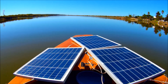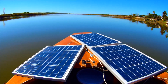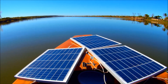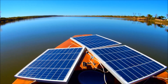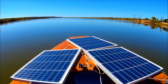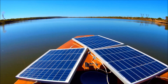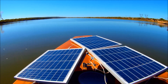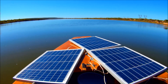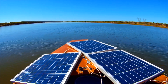These are 50-watt panels, but with the sun so low we're just not getting that power. They put out maximum power at 18 volts according to the specs — I've found it's closer to 16 volts. Since my battery is just over 13 volts, I've just connected it directly. No need for an extra charge controller as long as I keep an eye on the voltage — when the battery is full the voltage will top 14.4 and switch off. It's got built-in charge circuitry and the panels will go back to 21 volts open circuit.